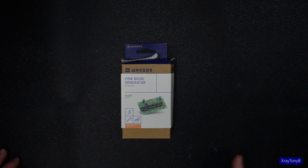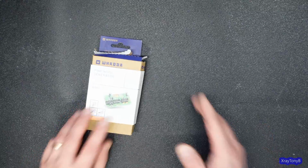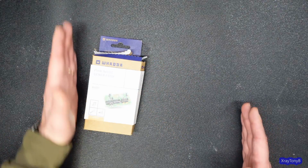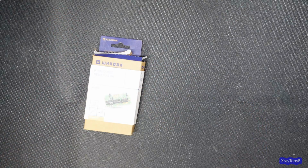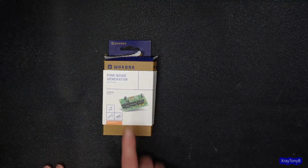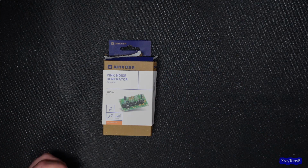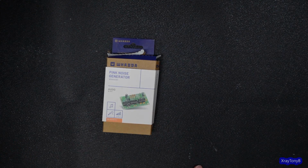Now, as far as electronics is concerned, it's very important because you're reproducing that whole energy curve at 20 hertz to 20 kilohertz, which is our hearing range generally for healthy ears. Some can go a little outside of that range, but most of us, that's the general rule of thumb. And this pink noise generator helps us to visualize how an amplifier or a piece of audio gear handles that. So it's a useful piece of test equipment.